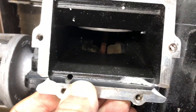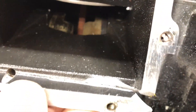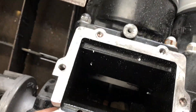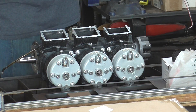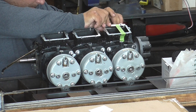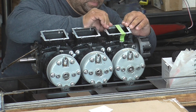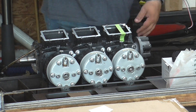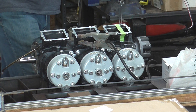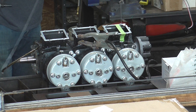This is where it's going to sit. I clamp it in place, get a good tack weld on the inside, and then I'll weld the outside all the way around leak tight. Here I'm lining up the part by eye — I use a piece of painter's tape instead of a real clamp since there's nothing really to clamp it to. Once it's about perfect, I make one little tack weld on the inside so I can pivot and tweak it off of that tack weld later as needed. It worked out pretty good.